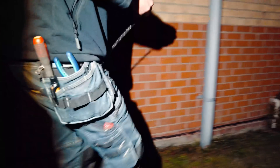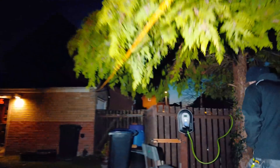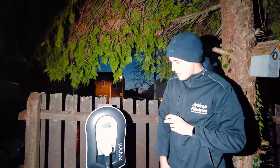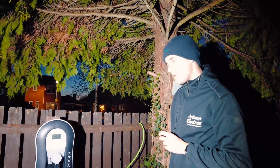At the other end, it nips down into the ground there — the warning tape and everything. It is so cold. It pops up under there — I've taken it underneath the wooden post and then cleated it up this side, and then I've put the armoured cable gland on there and it just pops into the back. Inside, it's connected up and the Cat5 cable just connects onto the CT terminal in there, so we've actually hardwired it — we've not used the Harvey. Looks awesome. A nice job well done.